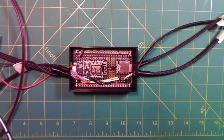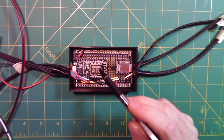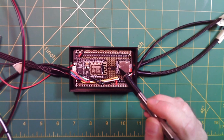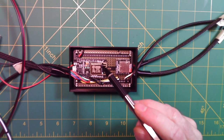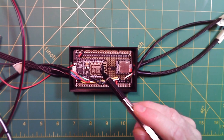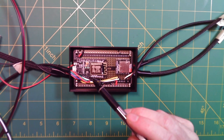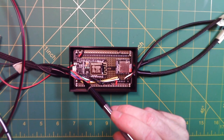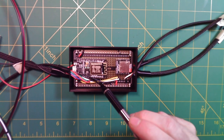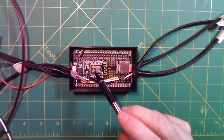I briefly wanted to cover the controller. My blog article has complete wiring schematics. Here's our NodeMCU and this is our DF Player Mini MP3 player with the micro SD card in it. There's a slight difference in wiring between Skull Head and Goblin Head — Goblin Head actually has independent eye control, so each individual eye can be a different color and each can blink independently, whereas Skull Head has a single control for both eyes. That takes three pins per eye plus ground, so six pins total — I had to repurpose the RX and TX, which disabled the Arduino serial monitor. All connections are either DuPont cables or, for the power supply, WAGO connectors, so everything can come apart and be stored.